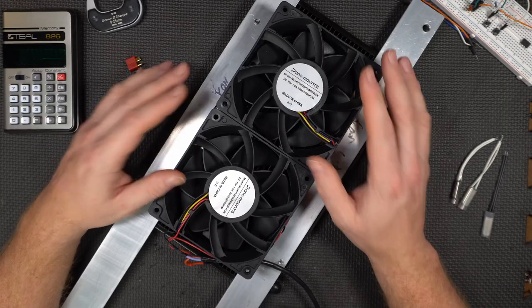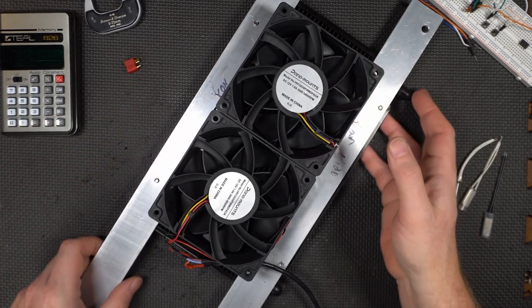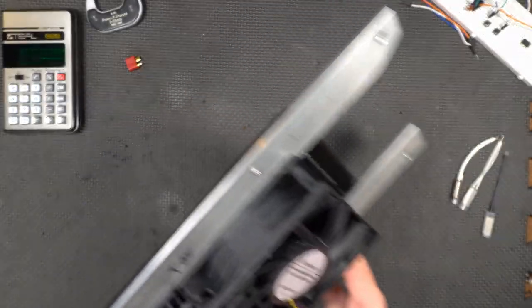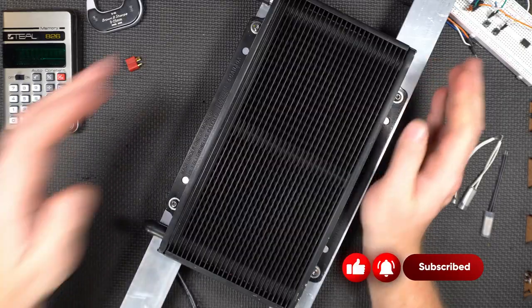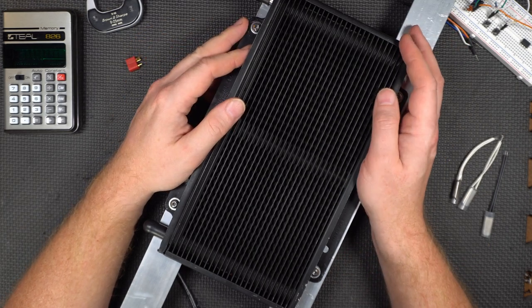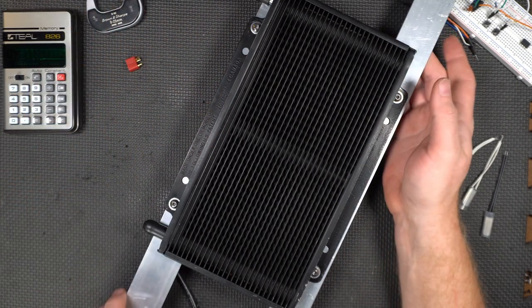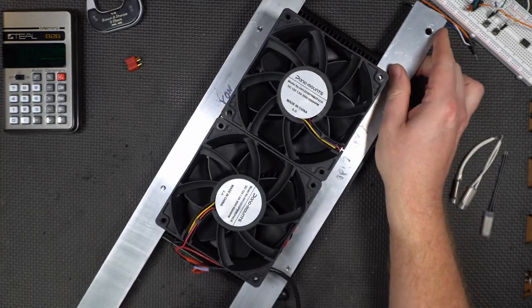After our last round of tests, I decided to pull the actual transmission cooler off the radiator and mount it separately and externally. And this is actually the transmission cooler. And I also decided, hey, it probably needs some fans. And I did some measurements, and guess what fits perfectly? 120 millimeter computer fans, two of them.